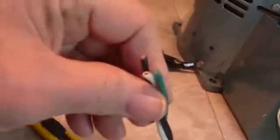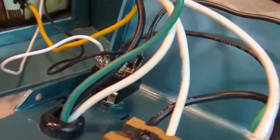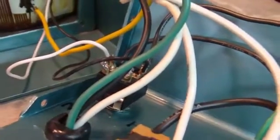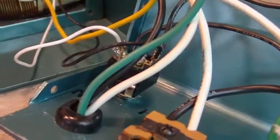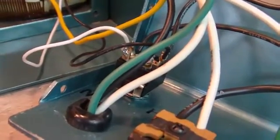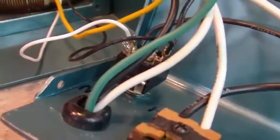What I did was end up cutting off part of the power cord — enough to get me over to the switch. If I had thought about it, I could have probably just cut the power cord off and left everything soldered like it was — been a lot easier, but live and learn. So I've got to hook those back up now, and I still have to hook up the neutral and ground for the relay. I'll find a cord for that — I think I can just use regular lamp cord since there's not going to be a lot of strain or stress on it, and it's going to be light duty anyway.